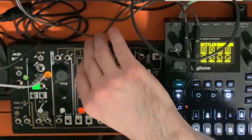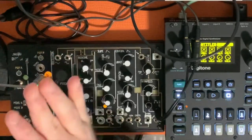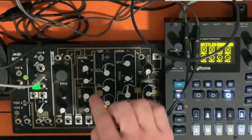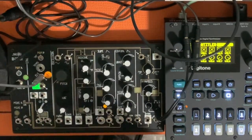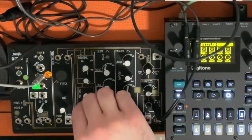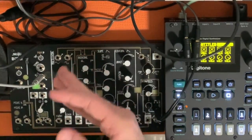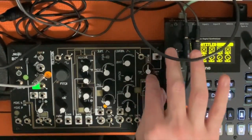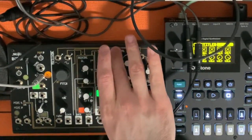The overtone basically adds additional harmonics to the sound, and multiply applies the multiplication on top of that to add even more complexity into the oscillator. The overtone has an input with an attenuator. Again, same as the linear FM, there's no inversion. It's just strictly zero to some amount of voltage. The multiply has an attenuverter, just like the second input of the mixer does. And what's interesting is that the next section is normal to the input of the multiply. So we're going to hear that. I'm going to turn back up the balance, the mix, and I'm going to now bring in the slope.